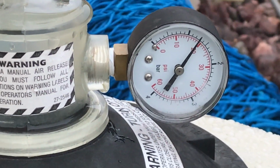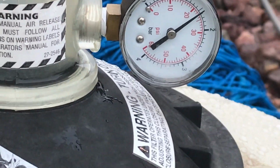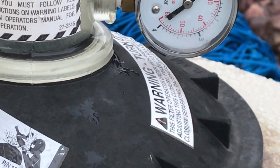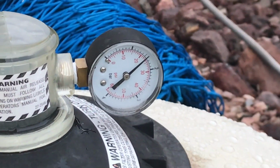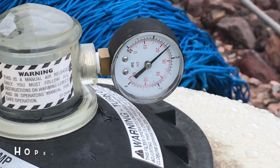So now one of the valves has cycled through, so the valve is fully open, and that tells me how much pressure was there. And it just continues doing that. So my average pressure on this is between 20 and 25, okay? I want to make note of that, so that when I shut off the flow to the pop-ups, that pressure doesn't really elevate much more.